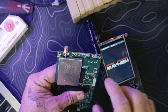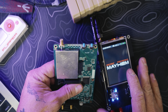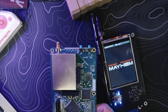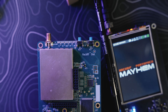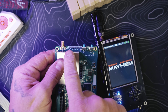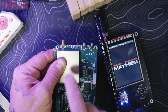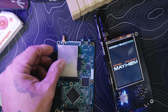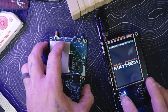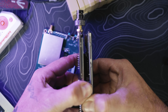This is my old unit that came with my PortaPack when I bought it off AliExpress. You can see it says HackRF One. This unit did not have the ability to resist an overload on the antenna amp, so this amp is actually blown. So I got on AliExpress and got the Clifford Heath one — the updated version.